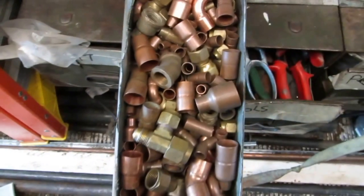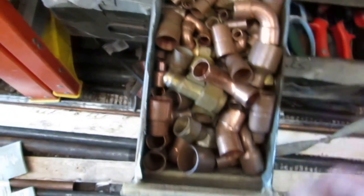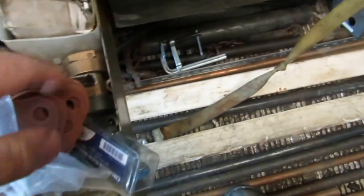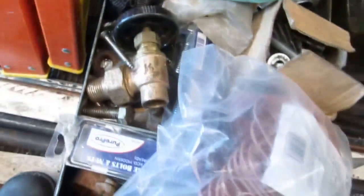It's all my refrigeration stuff — all different size small couplings, nineties, and flare. All small stuff, three eighths. Some more brass fittings in here. Down here I'm going strictly for boilers — football gaskets, a lot of them for circulators. All kinds of little vents, circulator vents. This is basically all stuff I would use on a boiler around the circulator, loaded in there.